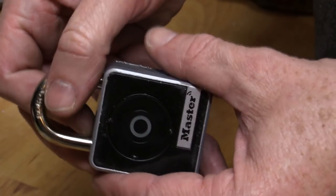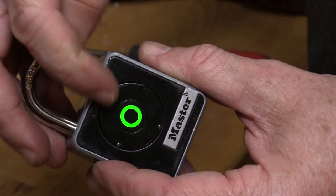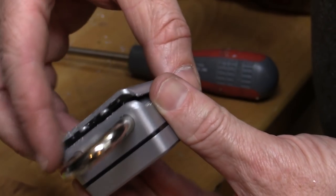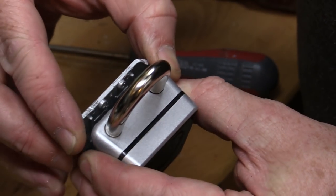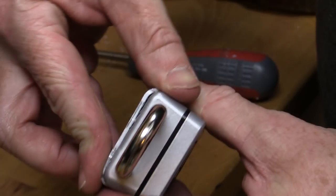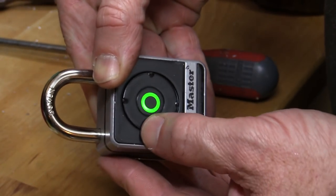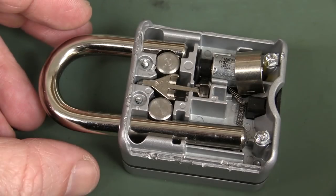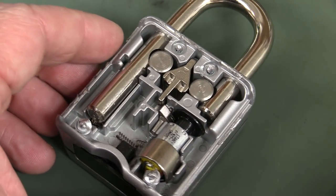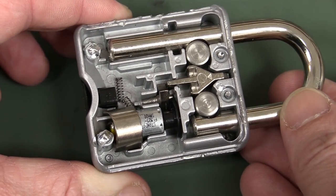This is interesting — it seems to have been permanently locked. Well, the green is supposed to be open but I can't enter the code anymore. I'm not sure if I've damaged it. I can actually see some sort of interlock in there connected to the back piece, so maybe it's got some sort of tamper thing in it perhaps. Ta-da! We're in like Flynn. And now we can see what's going on here, and why it was not susceptible to the magnetic attack — because it doesn't use a solenoid.